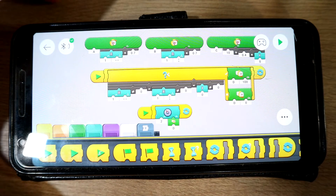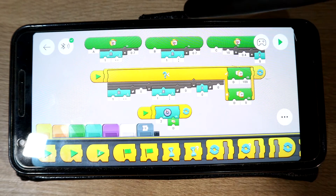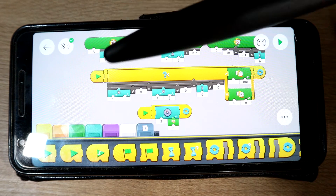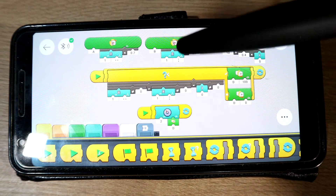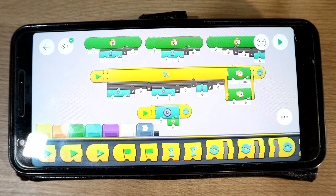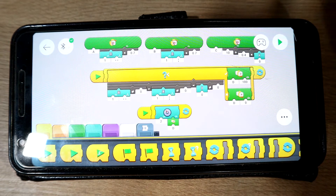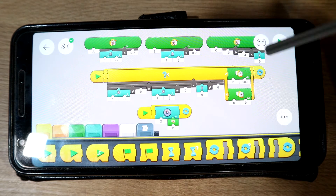This is a quick look at the code. We have three servo controllers here. This one is part of the multi-directional switch — that's the left or right one. That's the multi-directional one for the up and down. I've got these 0.7 multipliers here, and that's basically to stop the motor reaching its end travel and straining everything. I find that just makes things work a lot better.